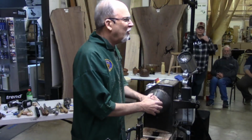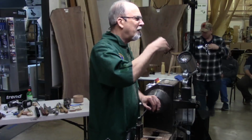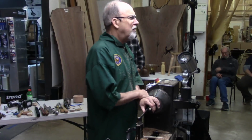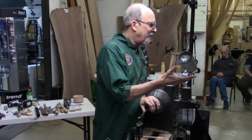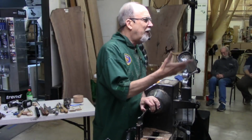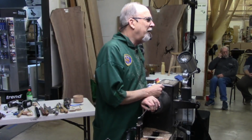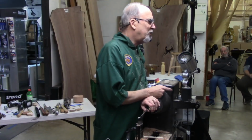Okay, a fractional drill bit is in between an 1/8 and 3/16 and something like that. And they've got all sorts. The one that I used tonight is like point 106, and an 1/8 is 125. And they have 109 and 116. And they're $1 each. They've all been resharpened. So they got them, they were throwaways, and they get them resharpened.